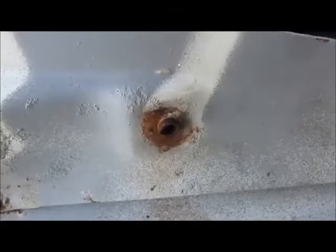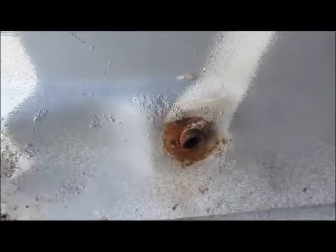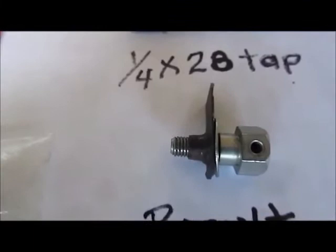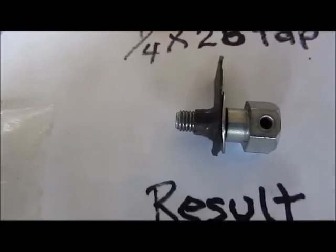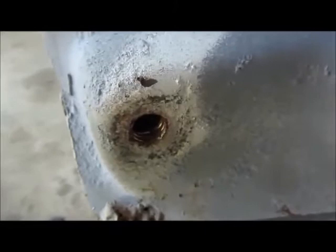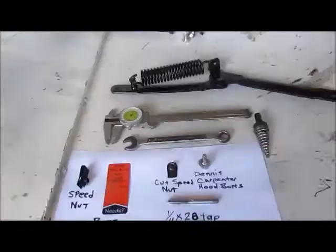On this one, I have a rusted-out shoulder — I'm going to have to grind that off. What I'll do is take this shoulder on this side and use my MIG welder to spot it a couple of times around so that I can put my nut in there. In this case, the shoulder pointed to the left will be sticking out and exposed. Over here on this hole, the shoulder will actually go inside — and always test-fit these before you start doing any welding.